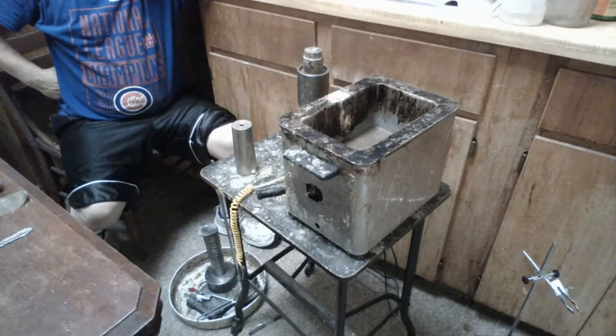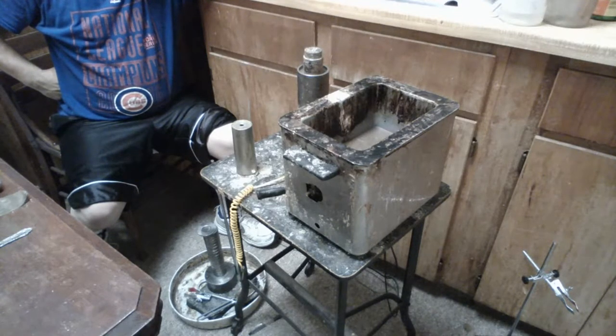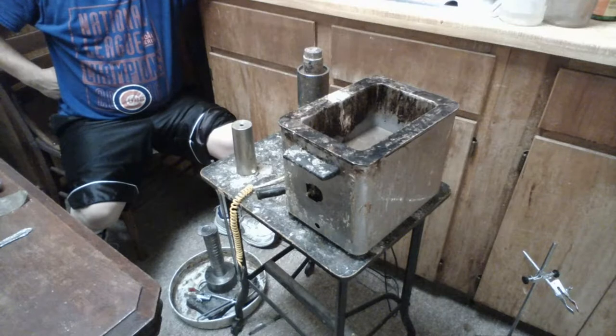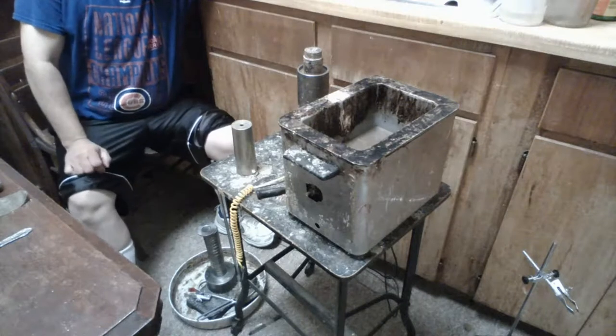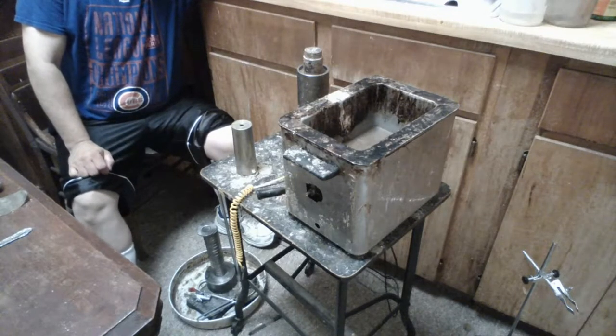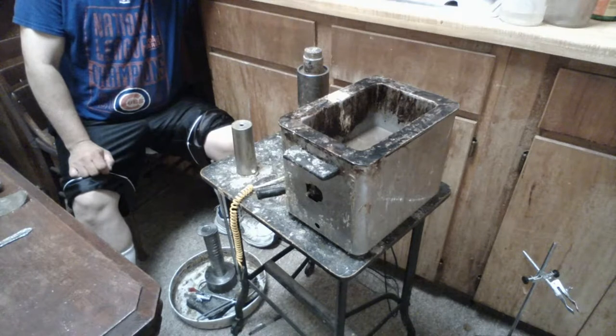But I made some of the non-metallic soap, what's called yellow paraffin cylinders, which they're not. They're principally stearic acid, ceresin, beeswax, and carnauba wax. There's carnauba wax in them. I actually have some of the wax left over, enough to make one blank from that batch, and then I'll make a blank for myself because I don't have one. I could always make the batch again, but this is the actual batch that I used to create the six cylinders for the display of the 1887 and 1888 Edison pre-perfected phonographs.